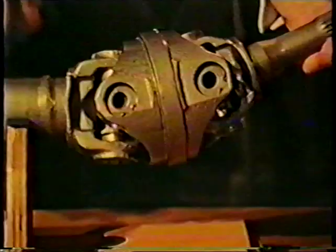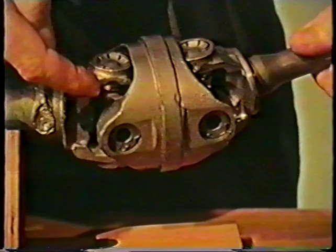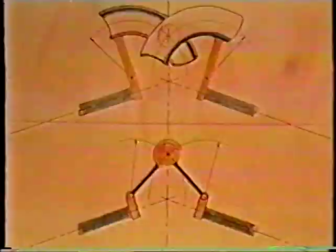One can also use two universal joints placed close in series with one another, with a central symmetry-preserving device concealed inside, which succeeds in bisecting the angle between the shafts very nearly accurately, but not quite. This kind of coupling is very sturdy and sensible for front-wheel car drives, but it's not absolutely 100% precise.